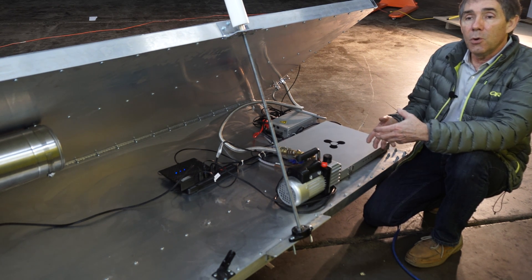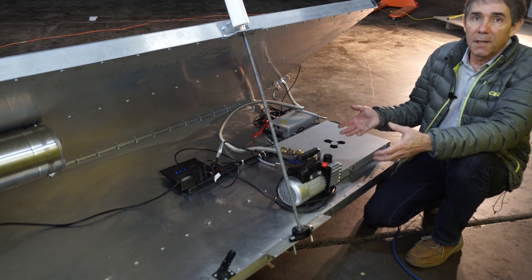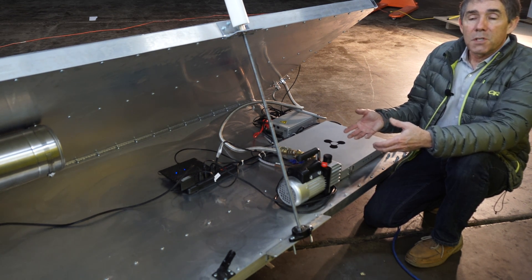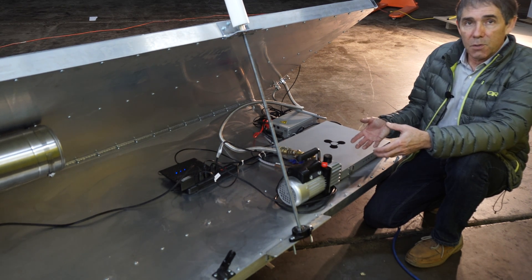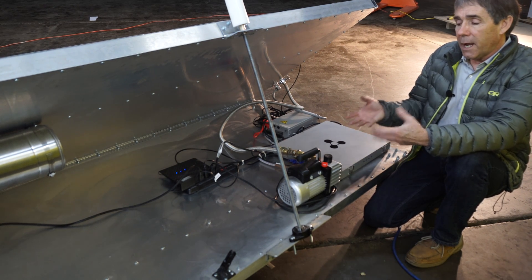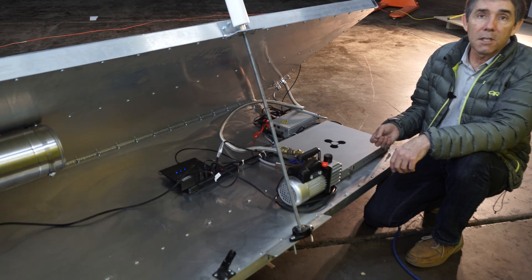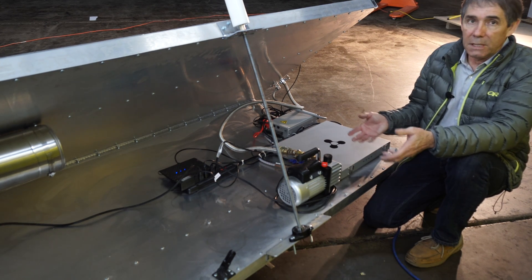The other component unique to the Tenkiv Nexus is the vacuum pump. Unlike other vacuum insulated collectors, we have the ability to continually re-evacuate the system. This means there is no expected end-of-life for a Tenkiv system. In vacuum tube collectors, the vacuum eventually dissipates because no system is perfectly sealed. In the Tenkiv Nexus, we continually pump that slight leakage back out, thereby extending the system's life essentially indefinitely.